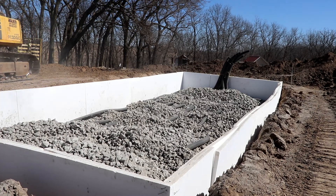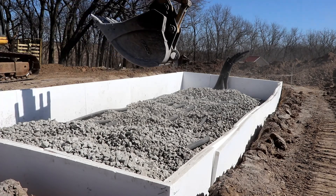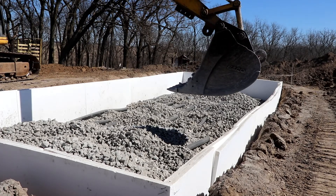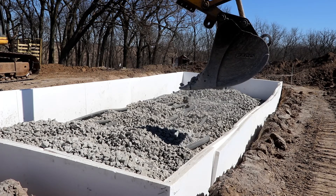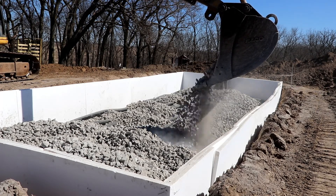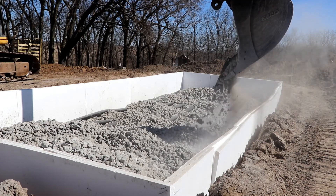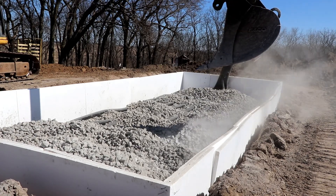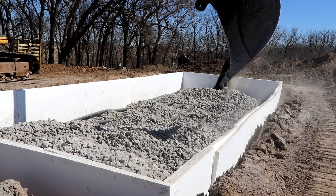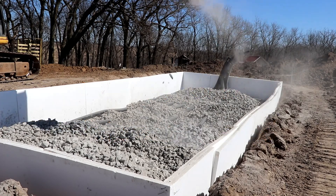There's going to be three and a half feet of gravel in the hole, and then the last ten pieces of drain tile are going to go in. Everything being buried under this rock is perforated — the air is going to come out of that and move up through the rock, and that rock is going to be our heat sink. The vertical pipe in the bundle is non-corrugated so that the air goes down and into the rock before it starts to come up.